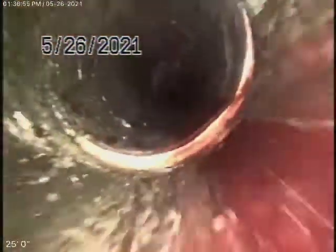This is the city connection running, and there's heavy root intrusion right at the bottom. We're definitely going to recommend a hydrojet because you've got some pretty heavy roots right at the city connection. It comes onto the property to the four-inch clay pipe. A little bit of roots coming in — these can all be cleaned out. Definitely going to need a hydrojetter, and you'll need some periodic cleaning here, no doubt about it.